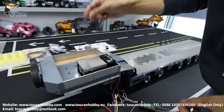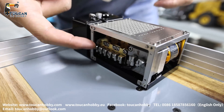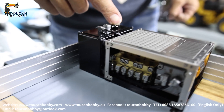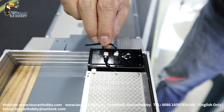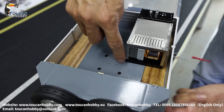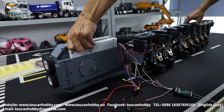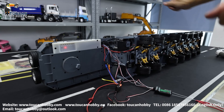And for the turning, let's see a little bit of the pump. If I turn a little bit, you can see it. Here are the pump and the distribution valve — three channel. The oil tank also got the oil level you can see here. Here filling up, here is the return line, here is the vent — only a hose for air vent. This side, you can see the motor, it's down here. And under there is a sensor for sensing the turning of the seat. Let's turn it around — you can see.